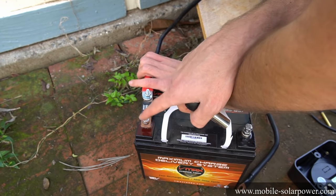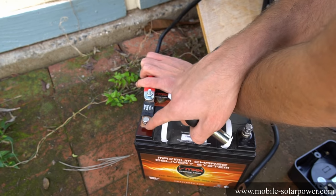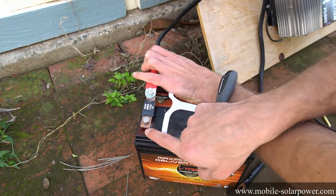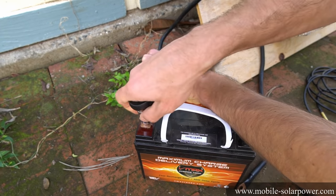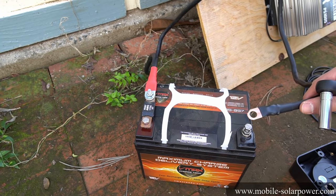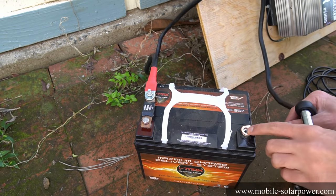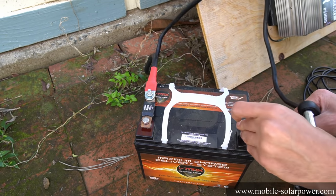Because this is a battery terminal, you do not want to use any washers except for lock nut washers, and you want the bottom of the fuse to be flush with the battery terminal. When you connect this for the first time, it's going to spark — that's because the capacitors in the inverter were charging up.